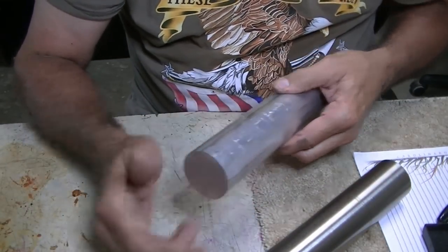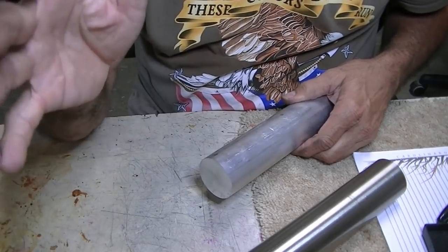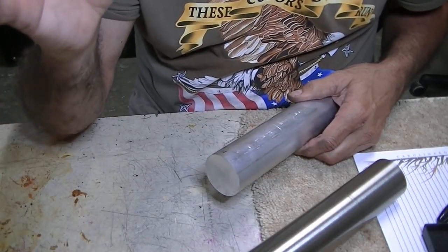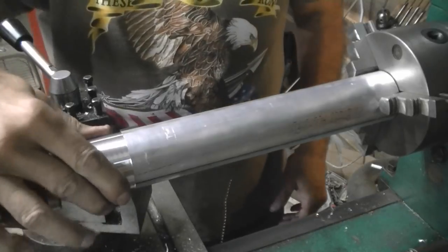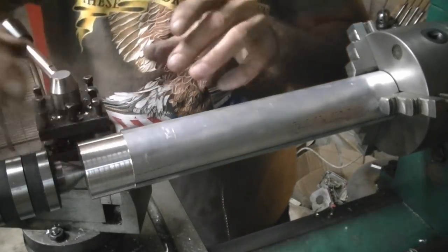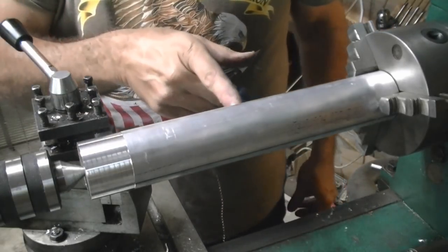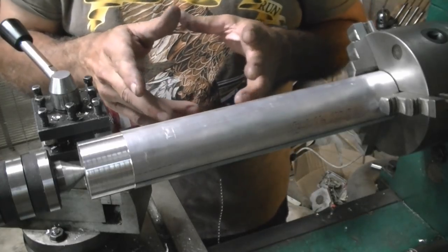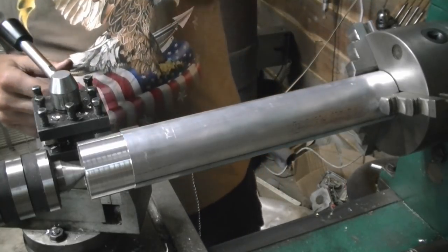In theory this will heat up the pipe and we're all good. I know the aluminum is going to heat at a different rate than the stainless steel, but sometimes it's better to just be ignorant and hope for the best. If it works, it works; if it doesn't, I've tried and learned something. I've got the aluminum chucked up in the lathe with a live center on this end and I've indicated it so it's running straight. Now I'm taking my first roughing pass — only going down about six inches.